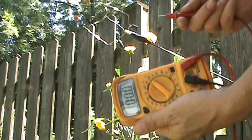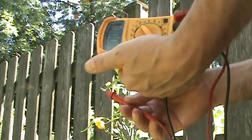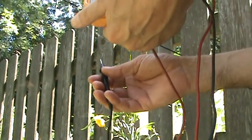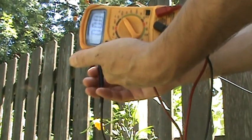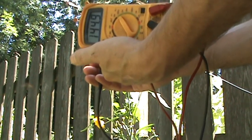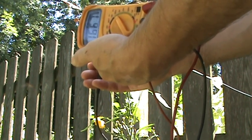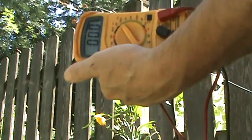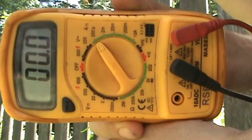Let's see if I can get this into view. I'm going to touch to those same spots — making sure we have our negative on the negative side, towards the stripe and the large capacitors. We're getting 160 to 170 microamps, and that is on the right setting — so you're getting the same thing I'm getting.